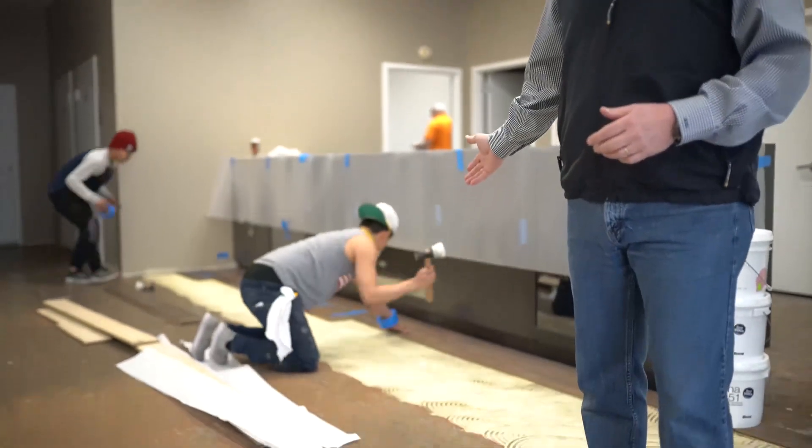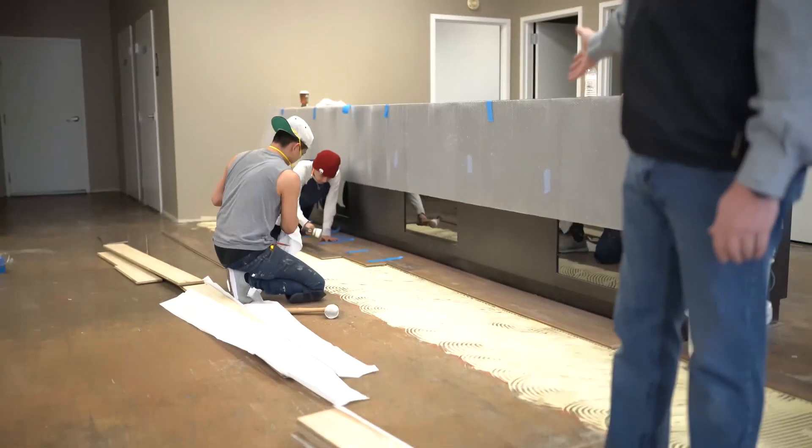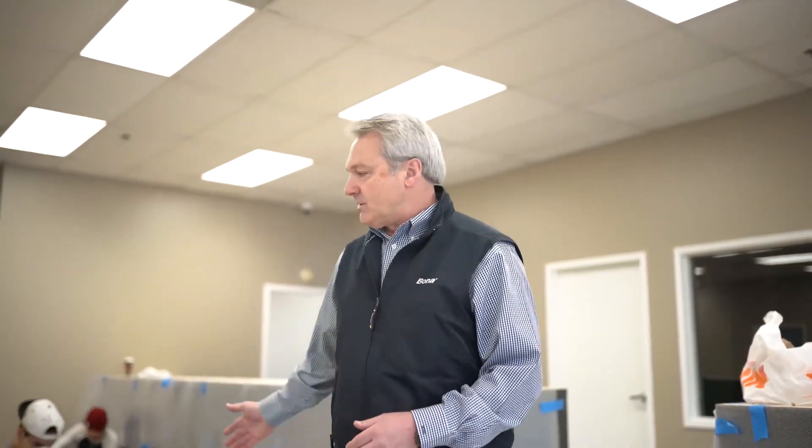Today they're starting to install the wood using a silane paste adhesive, the Bona R851. This is a very easy adhesive to use — it cleans off the wood very easily. Right out of the bucket it's 12 pounds calcium chloride and 85% RH, or 15 pounds calcium chloride protection using the back trowel method. The glue covers around 55 to 58 square feet per gallon.